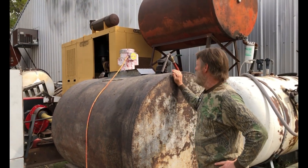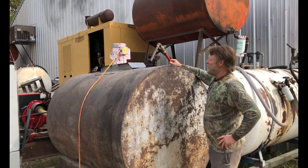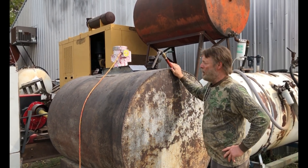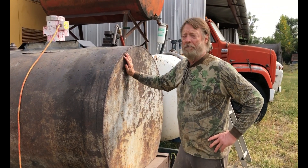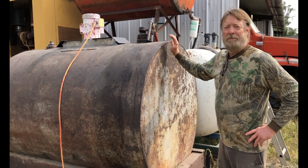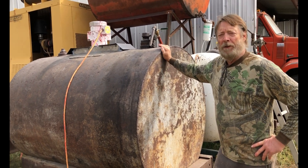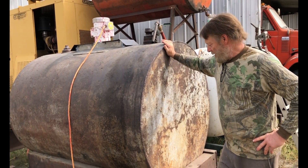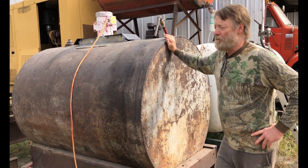From inside there, we're pumping it out through some packs which I found were good for vegetable oil, into a 500-gallon tank. We pump one of those 250-gallon tanks full of vegetable oil and fill it with number two diesel, two gallons of Marvel Mystery Oil, and another solvent to hopefully keep the engines from coking up.